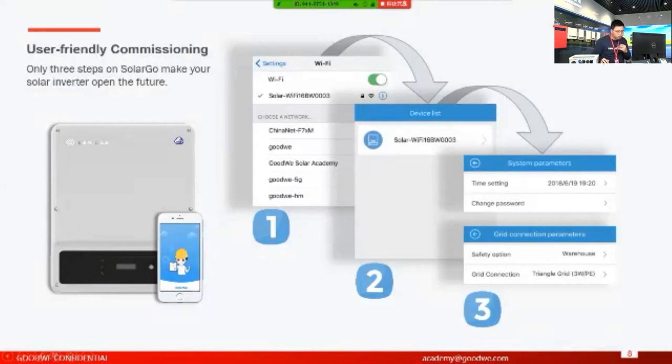Basically you can choose the country code in this safety option. For example, you can choose Sri Lanka, or 50 Hertz or 60 Hertz default, based on your local requirement or the local grid you are connecting to. Then the next one is to choose the grid connection, which is about the grid type you're currently connecting to. Normally we will choose the star type, and a delta type is also available in some of the inverters. With these steps completed, the inverters will start working immediately.